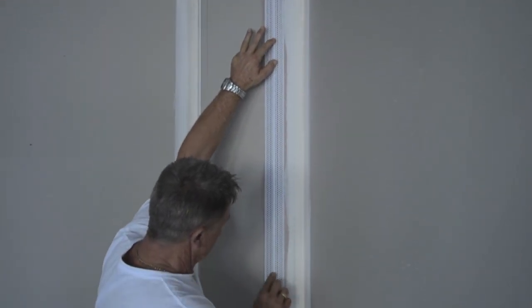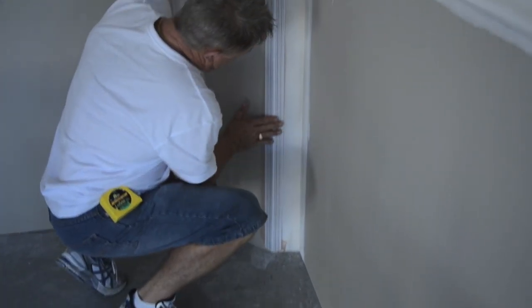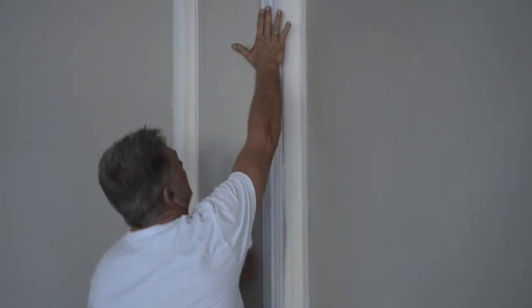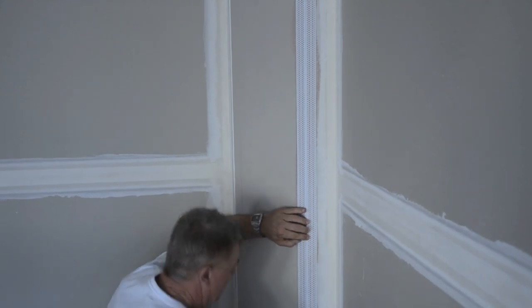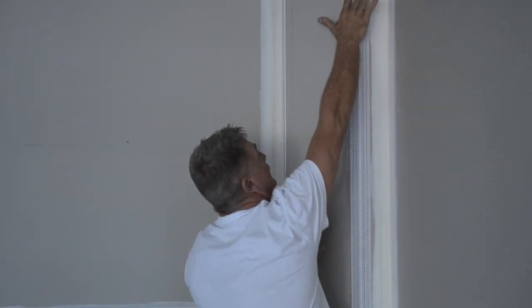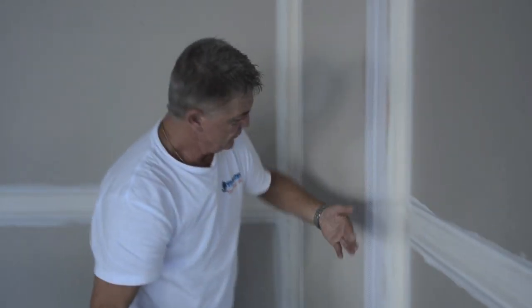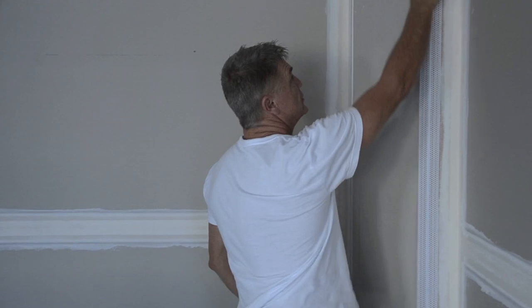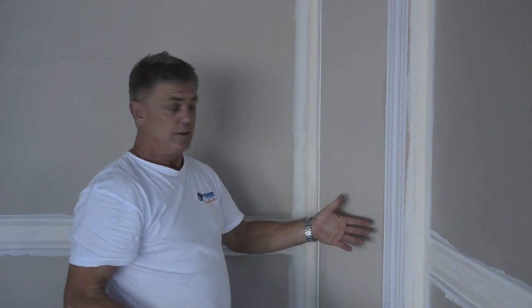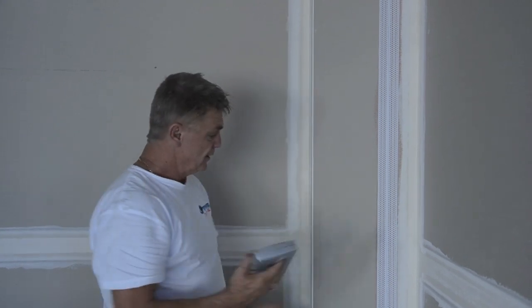So install the bead using the pre-scribed lines that you have up there before. You can actually use the little cleaning tool that comes in the box to wipe down the leg, or a blade. That's pretty well sit there now, holding into place. And we just go over it with a wallboard stapler, about 150 mil, 200 mil apart, about the width of the length of the tool.